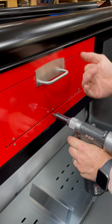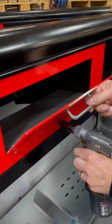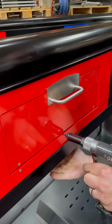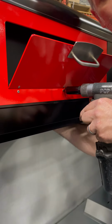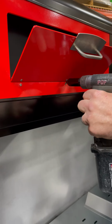And again, to check that you're not pushing the hinge back and that your rivet is fully through, you have to open the flap in order to get your hand behind. Because if it's closed, you can't get behind. So you need to open it in order to get your hand behind. And then you can feel that the rivet's through. And then you can rivet.